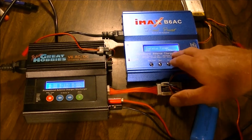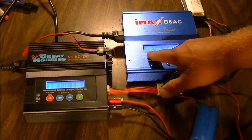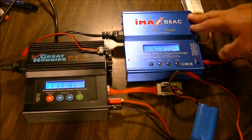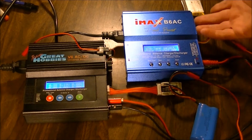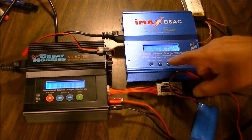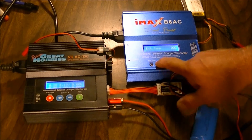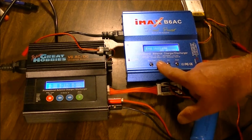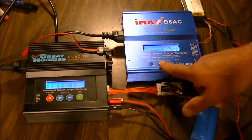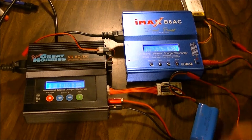And here safety timer is at 130 minutes — default is 120. Temperatures: this has thermal temperature sensors and all that sort of thing, although they didn't give me the cables for it. The connectors are there. So this will have a few features that this one doesn't have. End voltage is 8.4 volts on 2S, capacity cutoff, etc. Press the start button and it goes right back to where it's balancing.